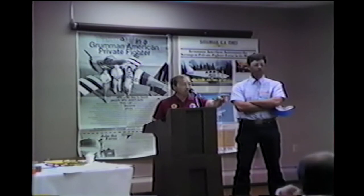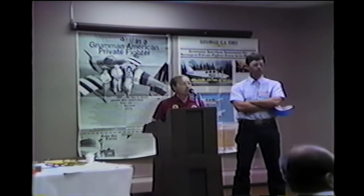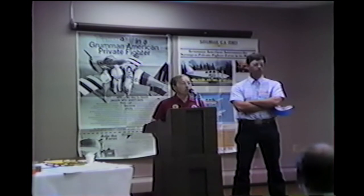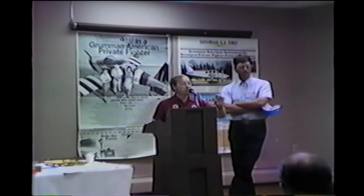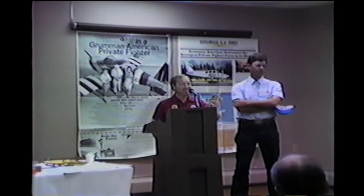You had your hand up there a second. Go ahead. Have you had any experience with spinners rubbing on the cowling with new motor mounts? Yeah. What do you do for that? There's a little thing in the parts catalog that refers to a little washer back right at each engine mount pad. And the nomenclature out there that tells you how many to use is A/R. That means as required. That is your adjustment. Trial and error, right.